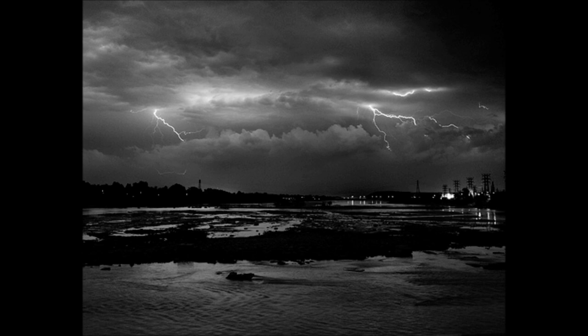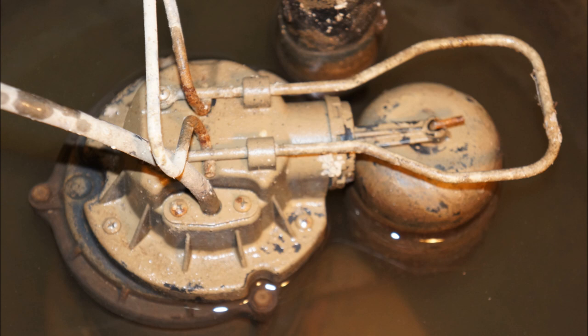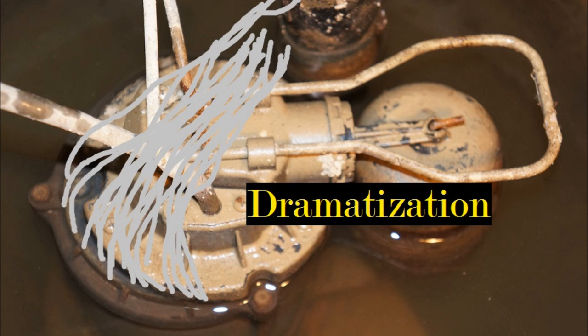It was a dark and rainy night. I could hear this horrible noise coming from our unfinished basement. It was the sump pump. Anytime something mechanical starts making strange noises, it's a red flag. And any time something mechanical starts smoking from overheating, that's not a good sign either. The problem? The sump pump was not shutting off, and the noise was from the pump sucking air instead of water.